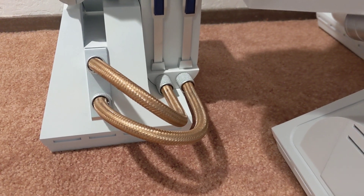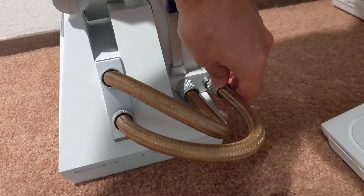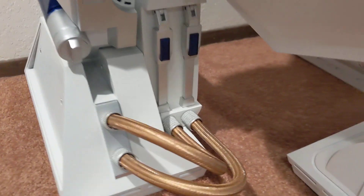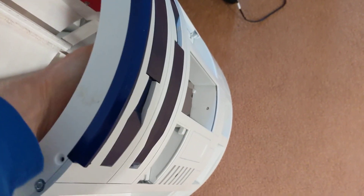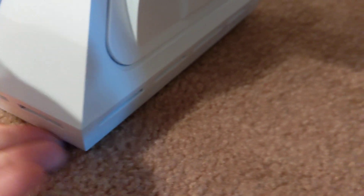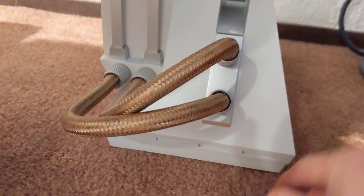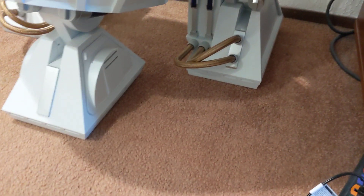If it happens, I'll probably print the part that screws into the battery box again in PETG with a lot of perimeters to make it stronger. Everything else seems to be okay — I have no power, but he does roll, which is good. I noticed on the carpet that the bottom of his feet are pretty much touching the carpet, because just the weight without any batteries, electronics, or the dome is enough to sink the wheels into the carpet right up to the footshells, which was a little surprising.